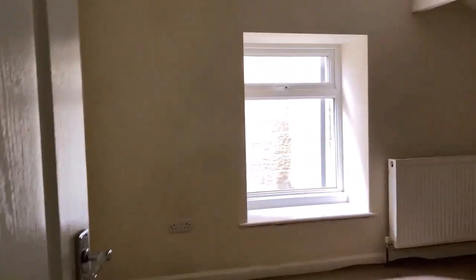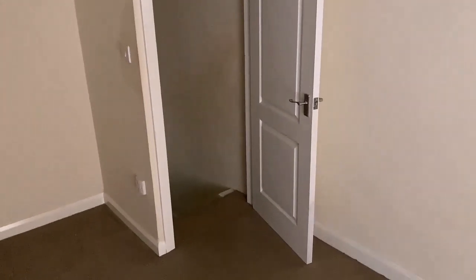Okay, so out we go and up to the second floor. There's only one major job to do up here really, and this is the side wall, basically the same wall as the chimney breast right in front of us there. The reason that needs sorting out is the dabs are showing through from the dot and dab plasterboard on that wall. It's not moisture coming through, it's the dabs just cold bridging from the solid stone wall, and they're extremely cold, so when condensation settles on them, it's causing damp patches on the wall. I will show you that in a second.